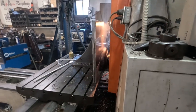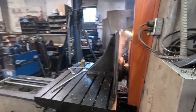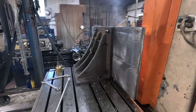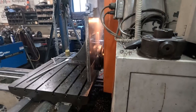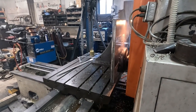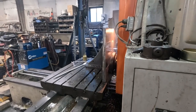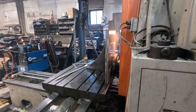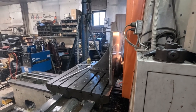I've gotten an unbelievable amount of time into this plate so far, and all I've done is deck one side off, rep out the other side, and square up one edge. I still got this end and the top to square off, and then a bunch of keyways and more to put in, so we've got a ways to go yet.